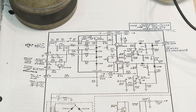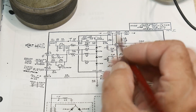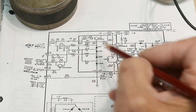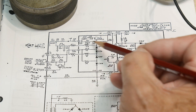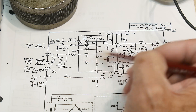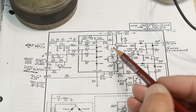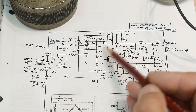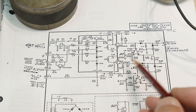The strange concept, though, is these two inductors here. What goes on in here? Well, you have an oscillation — there are some capacitors and inductors that go into this particular transistor, and that's the oscillator. This thing oscillates, but there's no direct connection to the outside world. The connection to the outside world is through this pickup coil and this pickup coil. Each one picks up the RF energy and amplifies it.